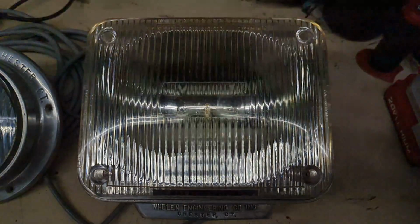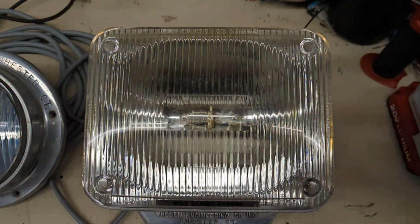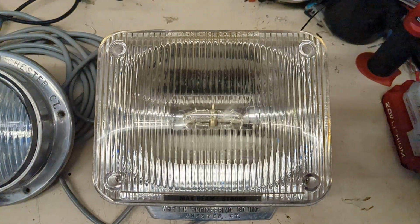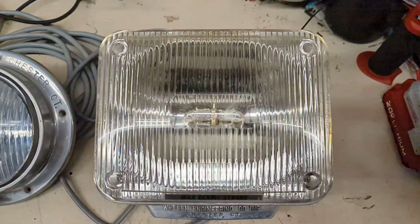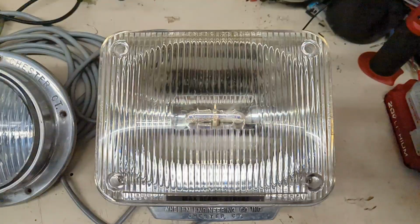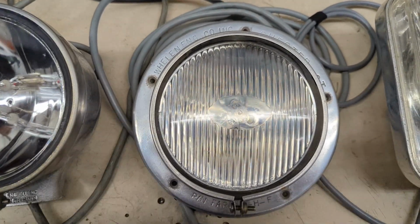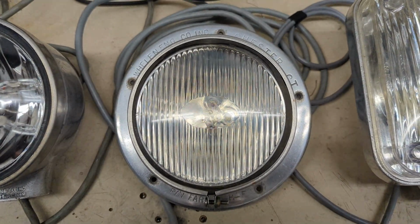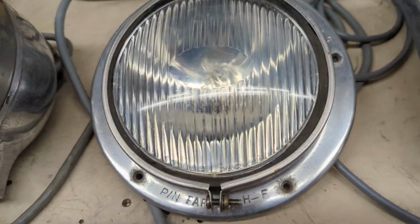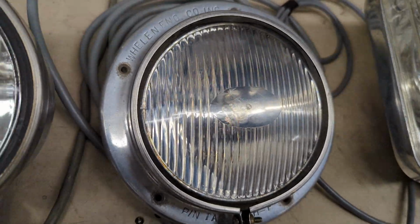There's not a whole lot of information out there other than the catalogs that I've already displayed that really give a definitive answer as far as what was the mode of powering these light heads. But I would pretty firmly state that I do not believe the internal power supply, cast housing, PAR 46 and 56 light heads were what Whelen considered the piercer. Neither of those seem to have power supplies that would produce the 120 flashes per minute, and Whelen's own literature seems to state that the power supply is the piercer part of the setup, and that you can use a variety of different clear strobe heads.